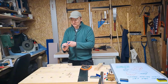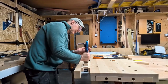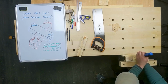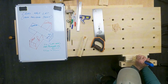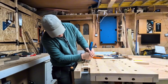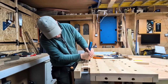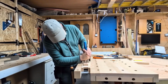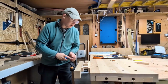So I'm going to take my chisel, hold it by the neck, firm grip on that, use the back of that chisel, and tilt that blade at a slight angle and cut down into those fibers. And then angle that way and cut across into the fibers. When we see it from this side, we're going to go down here and it's tilted. I'm going to drag across this way and then I'm going to drag across there. And that cuts those fibers in there. So when I break into it, they should easily cut out.